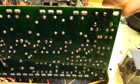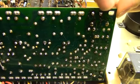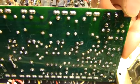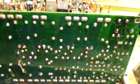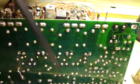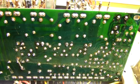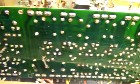Alright, with the power transistors and the heatsink out of the way, we can actually have a look at just how reworked this board is. So this board hasn't received any particular solder reworking. All those redone joints you see, such as this entire cluster here, these, all of these, they are replaced components from when the amplifier blew up in its different stages of explosive behavior.